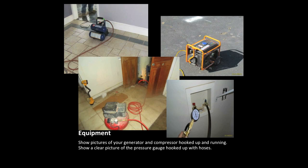Please make sure you have the proper equipment for this job. Your air compressor should easily be able to blow all the water out of the lines in a short amount of time. When the air compressor is hooked up to the pressure gauge, show the pressure gauge hooked up to your hoses. With the pressure gauge hooked up to the water lines, you are blowing compressed air to remove all water from the lines. Go around the house and open up all the fixtures so the air can blow all the water out.